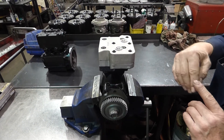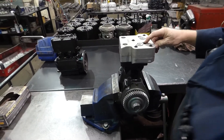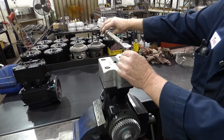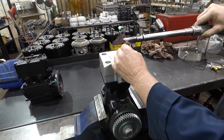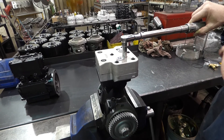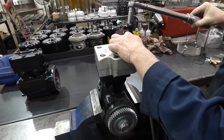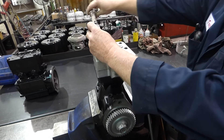Now you're going to start again on the sequence and pull them 90 degrees. What that means is you're going to take your torque wrench — or swing handle — after you've already done the initial torque, and go from one position all the way to 90 degrees. That's going to torque the yield on the thread, and you'll find it's extremely tight, but that's what we want. 18 and a half foot pounds on the four main bolts, then 90 degrees following the sequence on the sheet.